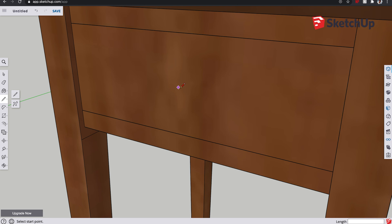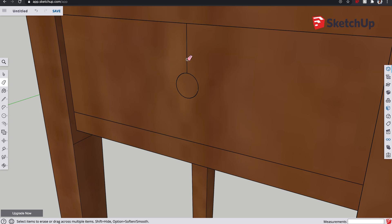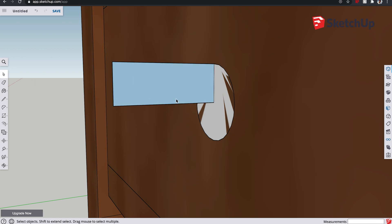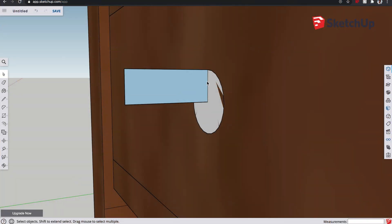We could add a little handle to the front and we're going to make a turned handle. Firstly let's get the centre of that drawer front, get the circle tool - 15 millimetre diameter at the base, so 7.5 millimetre radius. Rub away the construction lines, then find the centre of the circle - it should snap onto that. We want it to stick out about 25 millimetres. Then get a rectangle from that point joining from there to the top of the circle. Effectively we want to draw a cross section of the handle, and then use the follow me tool to follow it around the circle to create the turned component.